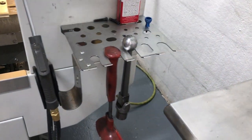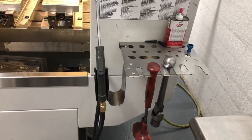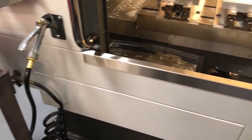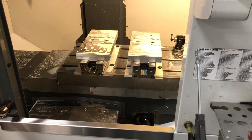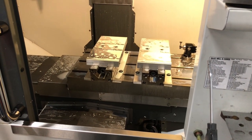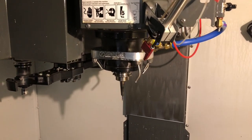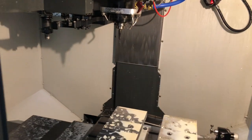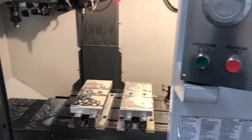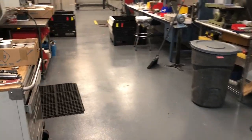It's got a little tool tray in the front, you've got the air gun every Haas has, and your coolant washdown kit. The other thing I opted for was a bigger coolant pump — I don't even know if that's necessary now because I think they did upgrade their pumps. But personally, I'm a big believer in coolant — you need enough volume and pressure to do whatever job is going to come along. Overall, if I was going to buy another machine for the shop, it would be another DM.